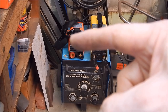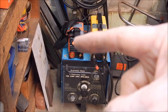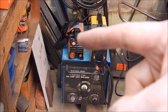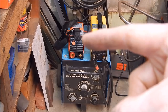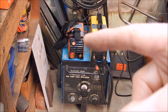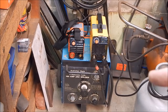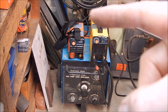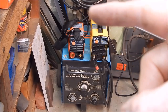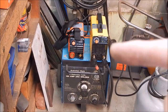You can buy really cheap ones at roughly the same price as the Banggood one, except you don't get leads with the Banggood one. Whereas at auto shops and large suppliers you get leads, but generally the duty cycle will be crap. That's how they cover the costs. You're better off getting one with a good duty cycle, then using your existing leads or buying leads of the right length and size. I use these big 400 amp Siemens cables, about five meters long — fantastic, you don't get any voltage or amperage drop.